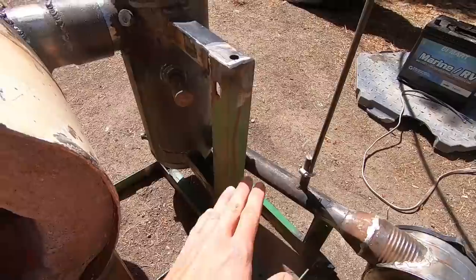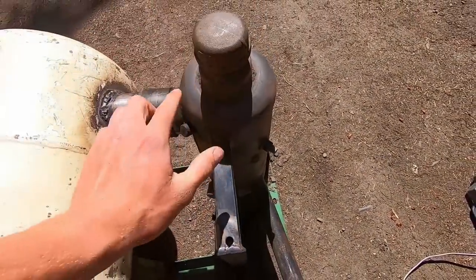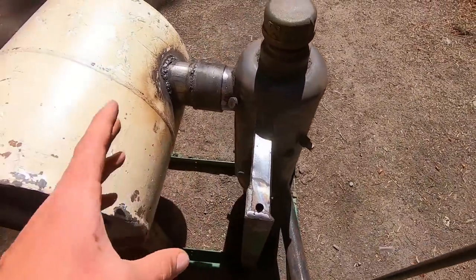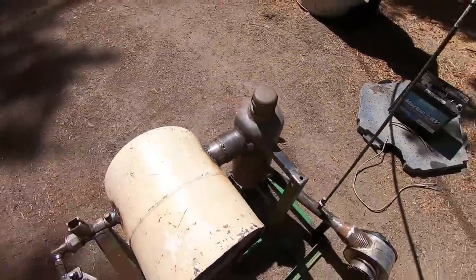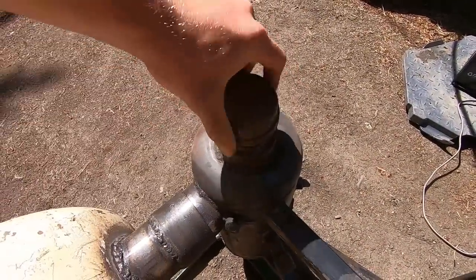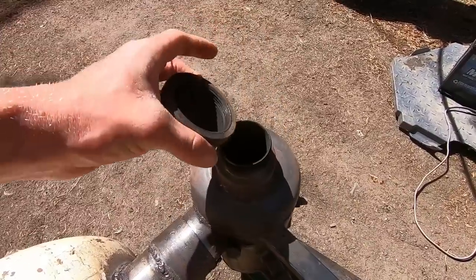So that goes down here, feeds to the tube, and then it runs into a burn vessel, like I said, and this is just actually a tank from an air compressor that I recycled. It's got a lot of fancy things on the side, but none of those are actually important to the functionality. So on top, we've got just a 2-inch cap because this is where ignition takes place, where we actually light the system and the oil. So we're gonna remove that.